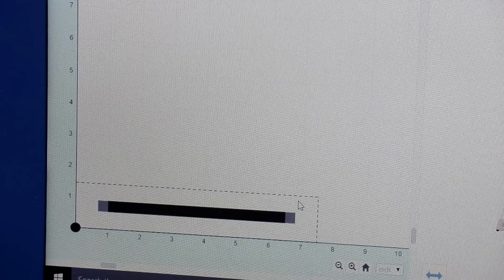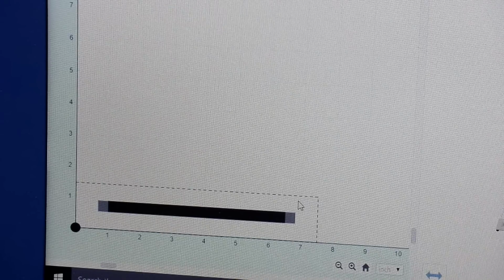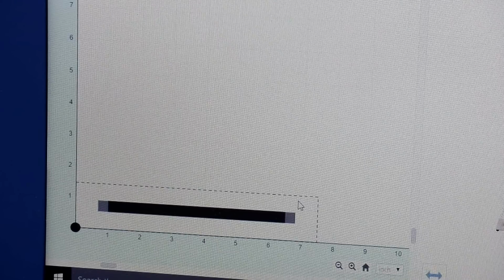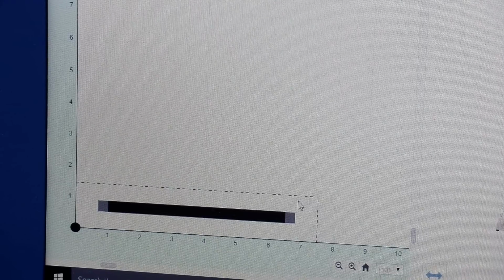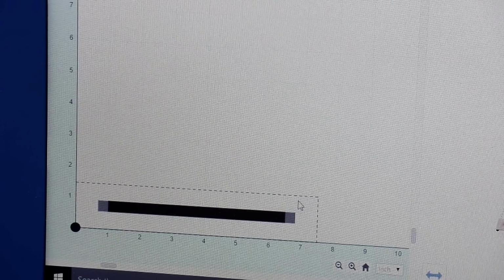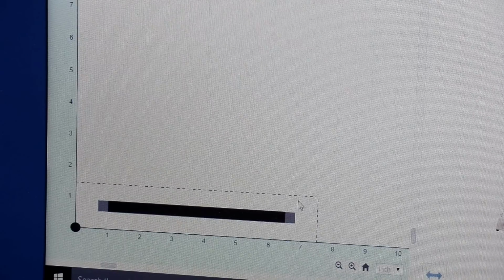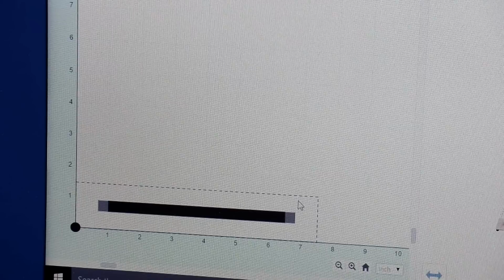Basically, we're going to cut a groove in there that is just thick enough for the acrylic to slide in there, and it goes down about 1/2 inch, and then it gets narrower and goes all the way through the bottom. So basically it's going to create a little 1/4 inch shelf on each side for the sides of the acrylic to sit on. Then there'll be a gap underneath that where the LED lights will be poking up, so that the acrylic isn't sitting right on the LED. And we'll carve out the bottom to leave a space for the cord and the wires for the LED to come out and things like that. So this is for the top.